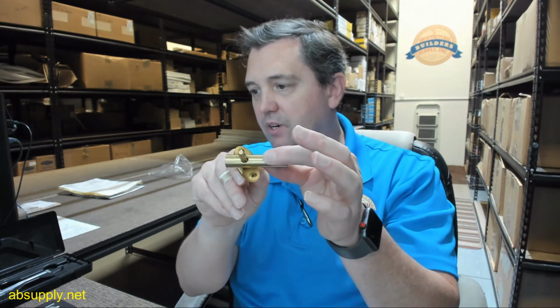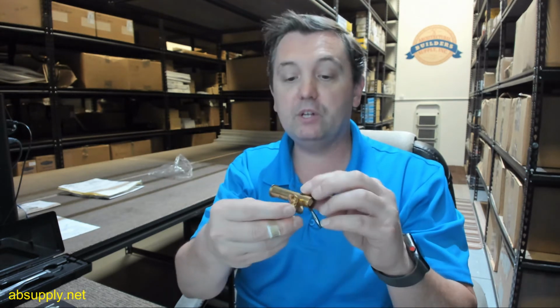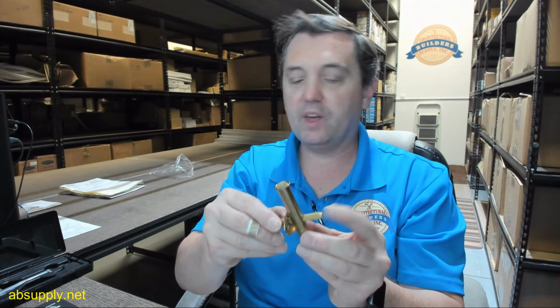1 3/4 from door edge. That's going to be a reference to the back set again. Place the bolt in the hole, meaning slide this unit in, insert the knob shaft in the hole, and align with... You're just going to insert the shaft through the hole. And then you're going to pre-drill your holes for these 2 screws to attach the escutcheon down to the face of the door. With hardware like this, you really want to do a reality check. That 1.25 deep, this is a little bit too long for that.